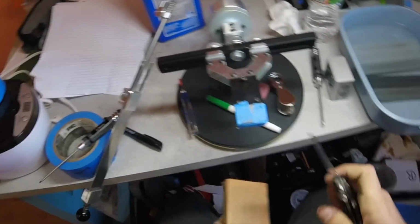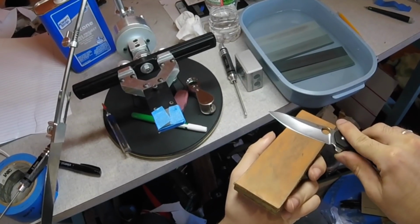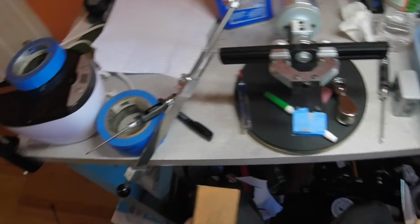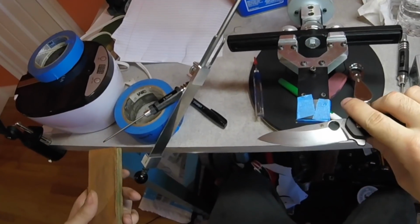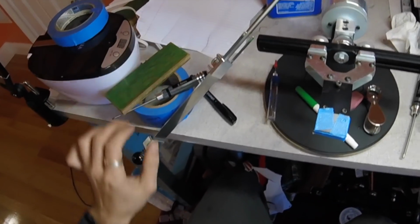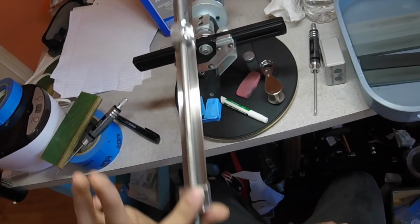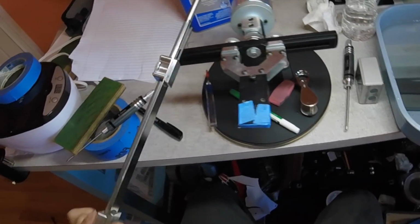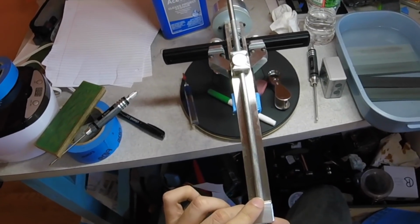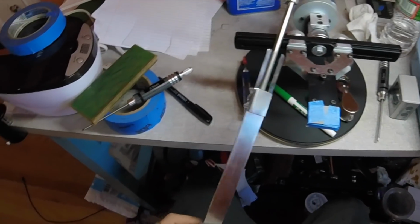And again, that's why people will tell you reduce your angle by 2 degrees, because that way when you push, it'll then meet your apex instead of rounding it over. But if you have the right angle and you use 0 pressure, at most just let the weight of the arm, okay, and then same thing with what I said before, pick it up a little bit, take the pressure off even, okay, you do that, you meet the angle.